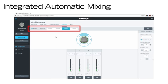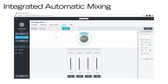You can choose between four mix modes to fit your setup. Classic mode provides the same great Shure automatic mixing from the SCM810 and SCM820, with a fixed off-attenuation level of minus 15 dB.